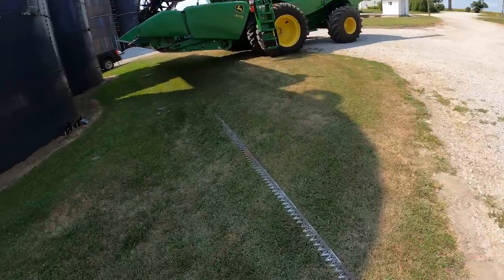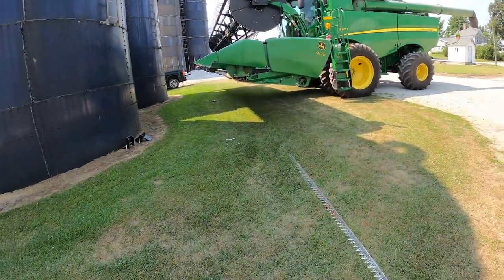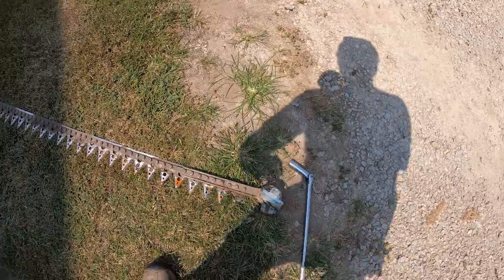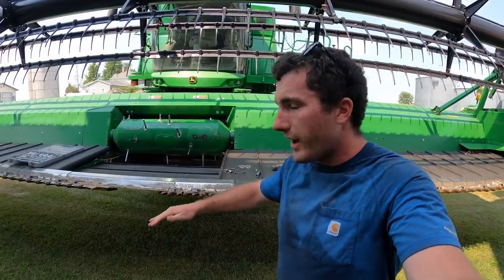It's nice having dual motor drive. That way when you're cutting perpendicular to the rows or something, you got a large load across it. You're not breaking your bars all the time and running out of power with not having more than one motor. The draper's job is much simpler than the corn head's. It only has to cut the beans off at the ground, much like a lawnmower.